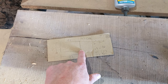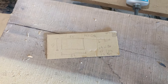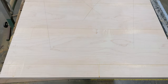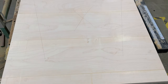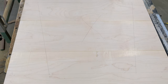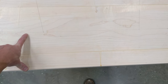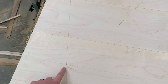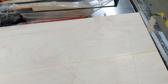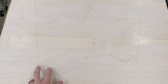I thought about doing miters on the corners with a really sharp angle, but I'm going to go with straight 90-degree joints and maybe add some decorative walnut dowel inlays to spice it up. Right now I'm working on one of the shorter side panels. I measured up from the bottom six and a quarter inches - the mattress is six inches, so that gives a little playroom. I have a beveled line: seven inches at the bottom from the edge, three at the top, leaving a two-inch piece across the top. I'm basically cutting out a trapezoid shape in the middle to fill with slats.